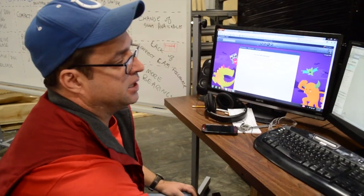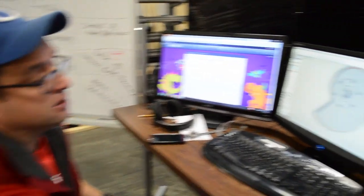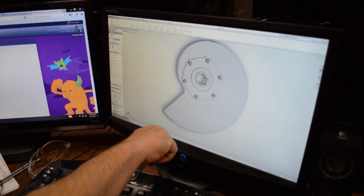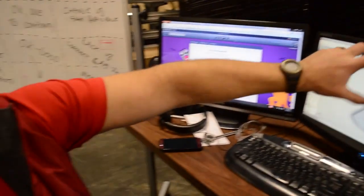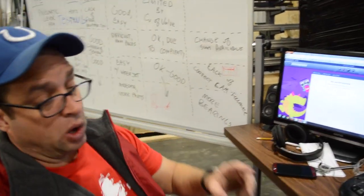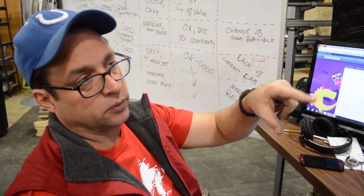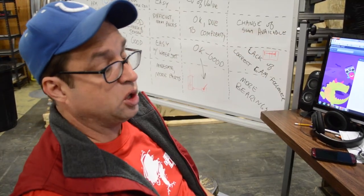The cam I have on my computer here — this is a six-inch outside diameter and this is a two-inch outside diameter, so the distance of the radius from edge to edge is two inches. That's a two-inch cliff that the cam follower would fall off when the cam rotates around. The bearing or cam follower would sit right here, fall off, and hit — that would be a very rapid release to let the arm go up.